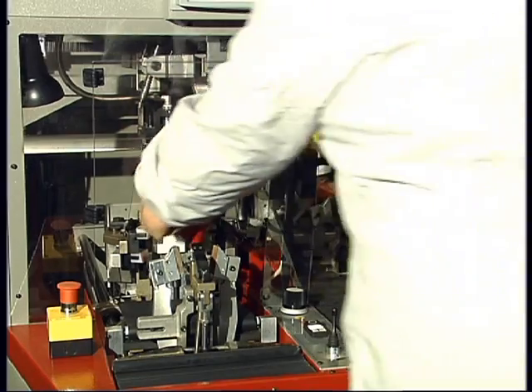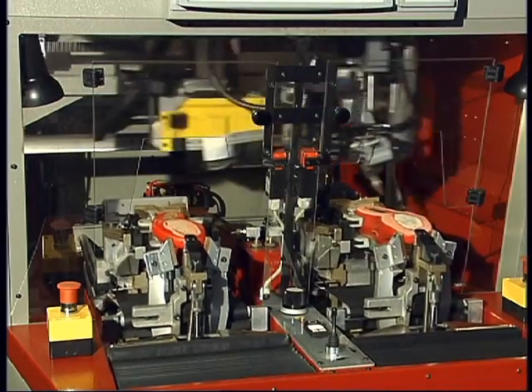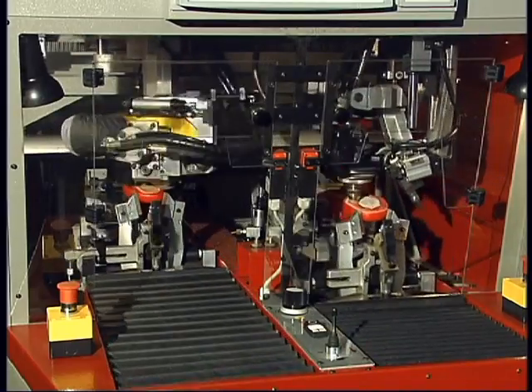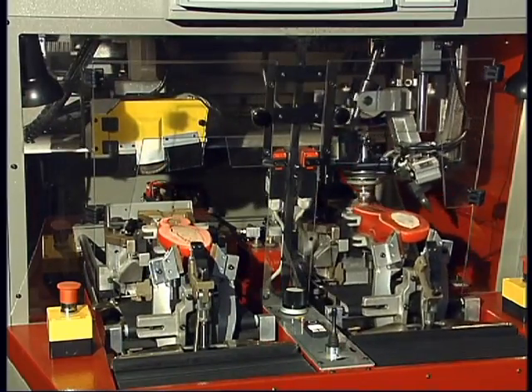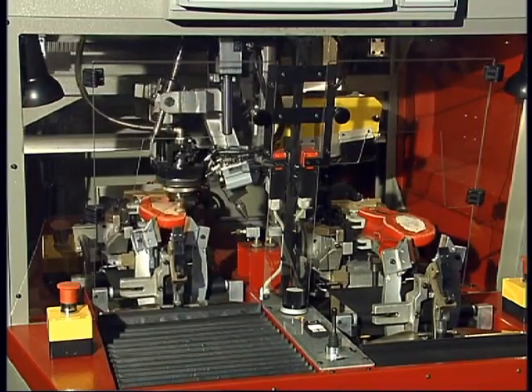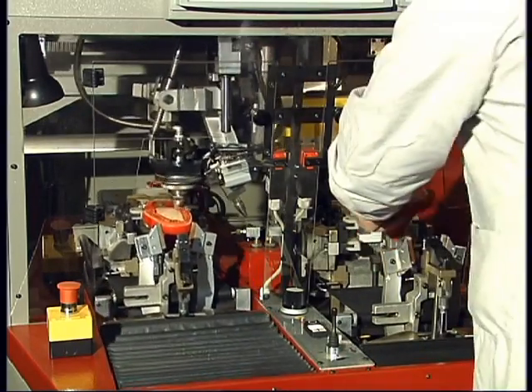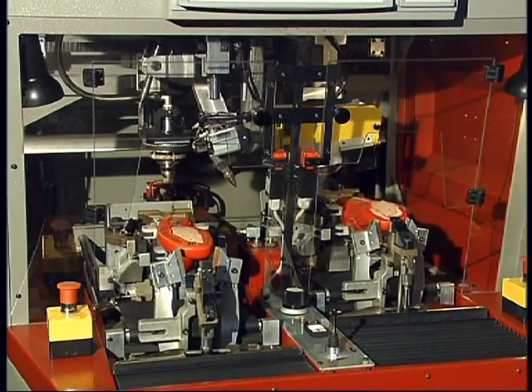After lasting, the shoes are loaded onto the machine. The first operation is roughing. The CD3DR then replaces the tool head and the cementing phase can begin. At the same time, a new roughing cycle starts on the other station.